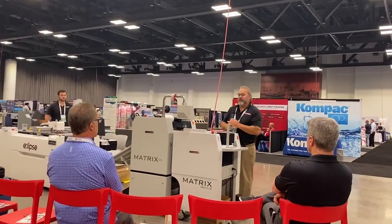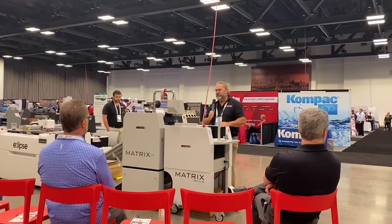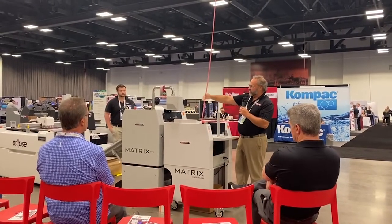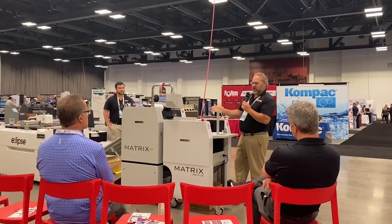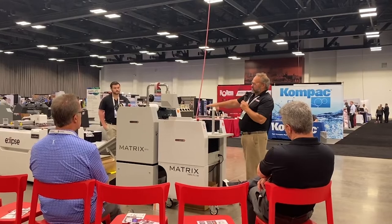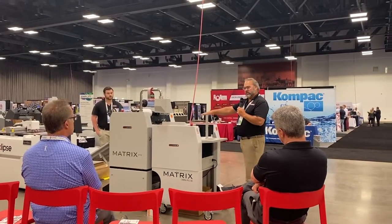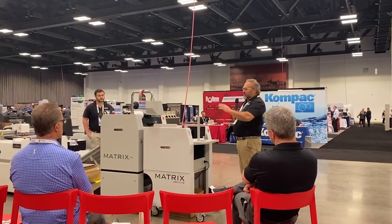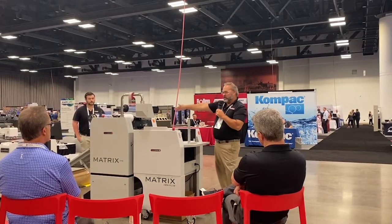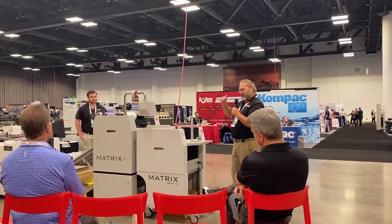What I want to do is show you how the machine works. We've got the auto feeder on there. This machine uses what's called a burster. The way it works is we size our film to be slightly narrower than our sheet that we're laminating. Then the sheets are underlapped — the following sheet underlaps over the lead sheet, so there's no exposed film. There's a little perforator on the side that will perforate the sheet. The last set of rollers are called burst rollers — they fire down and snap the sheets.